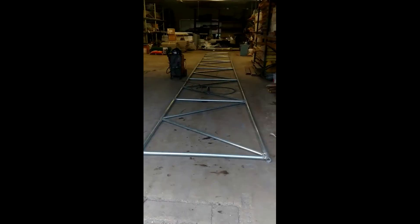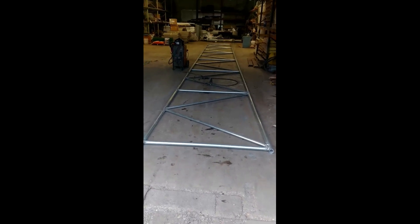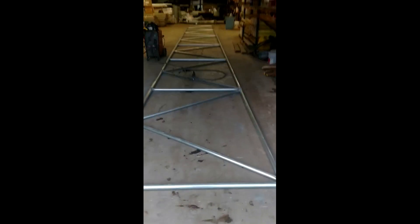The smashed ends lay on the pipe like so, and I trace where the line's going to be, then cut it and fit it in. If you do it well you'll get a gap roughly like this — I usually line it up and then trim it again. Here's my 49-foot gate — 32-foot chain link, 17-foot backstop — one side completely welded. We just flipped it and I've welded a few more, but I've got the rest of the welds to go. They turned out to be pretty tight so I won't have a huge gap to fill.